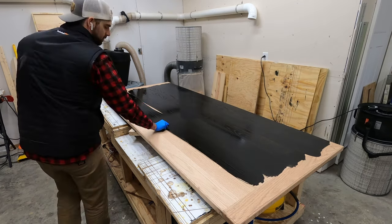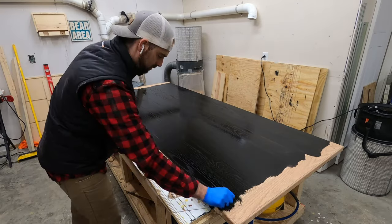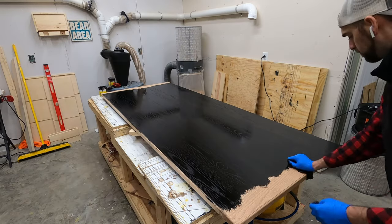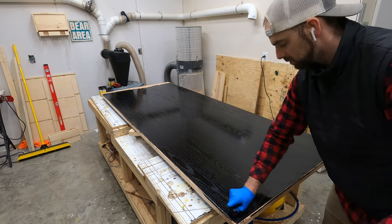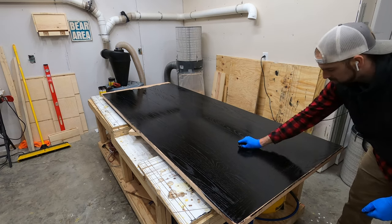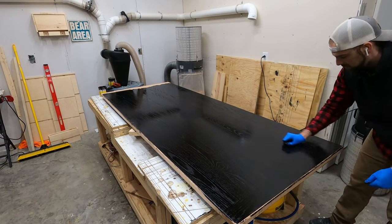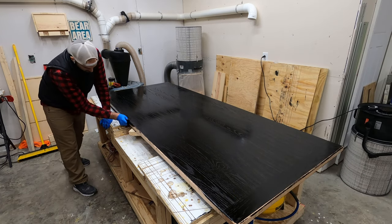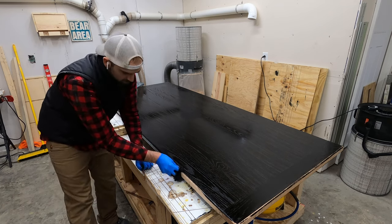As far as time goes, you want to do this somewhat quickly — not so fast that you feel out of control, but once you do get started, you want to finish the staining process all at once. Don't stain half of it and then go make dinner or coffee and come back to finish the tabletop later. After I have the midsection stained, I go ahead and stain the breadboard in the direction of the grain on the breadboard, then overlap the middle, go back and get the breadboard in the direction of the breadboard once more. Also equally important — do not forget to get those sides.